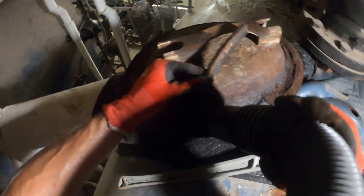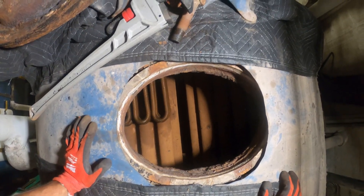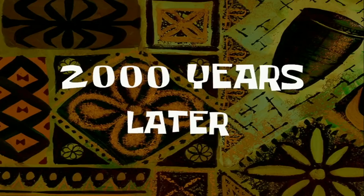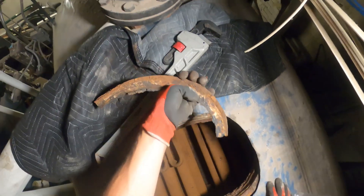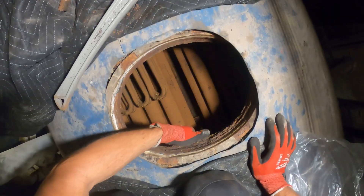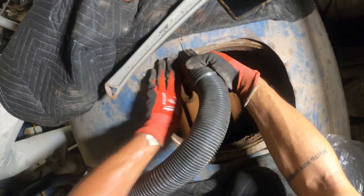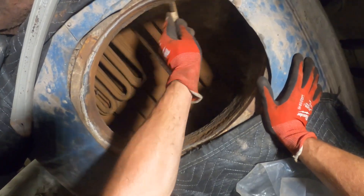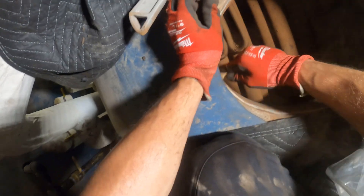Clean up whatever might have fallen in there — that's the heat exchanger. This whole thing needs to come out right away, especially this gasket. At least it's out. You can feel the heat — alright, turn it off. The whole thing fell outside, but we're gonna go take this and match it up at the shop. Two thousand years later — alright, we got new parts. But for now let's prep this. This gasket is stuck on here and really out of shape. Let's make sure we have a flat surface and everything's nice and clean so we can begin installing.